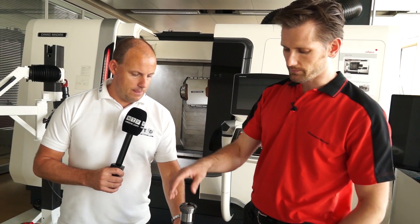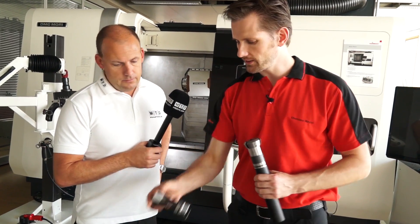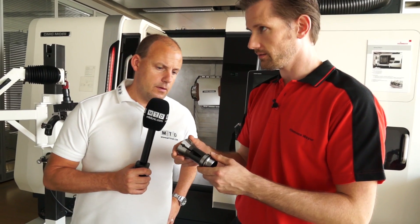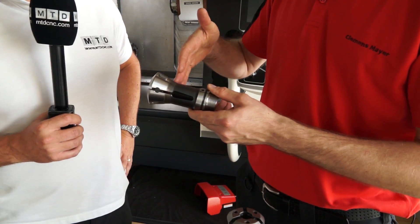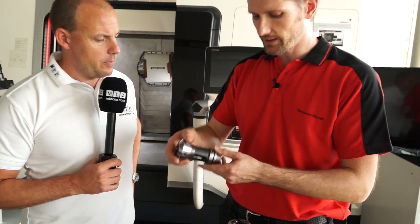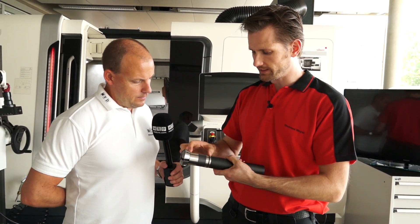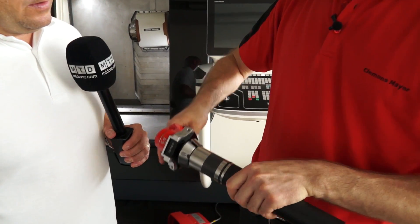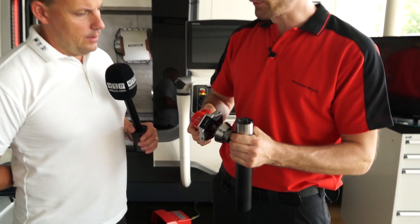So it was an improvement of the collet. The requirement was to make this collet more flexible. The general idea back at the end of the 70s was: why don't we cut the collet into two parts — the clamping element, the clamping head and the basic body. Here I have a sample. This is symbolizing the draw tube. Here is the basic body and here is the clamping head. With a changing fixture I can remove the clamping head and exchange it for another diameter.